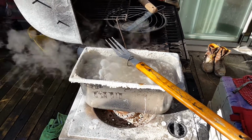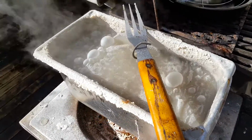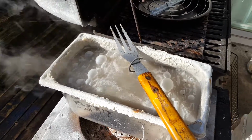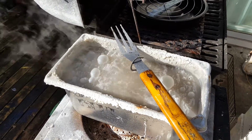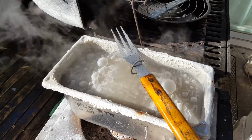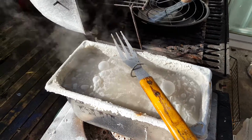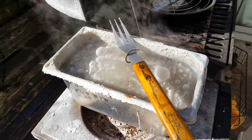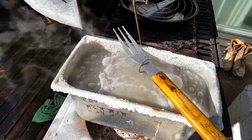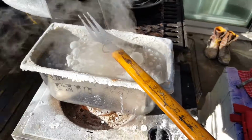So thanks for watching my nasty mess in the backyard here. One more thing, if you're bluing, it's got to stay at 292 degrees. Parkerizing is more like 190, but 180 maybe, but hot bluing 292. So get a little candy thermometer. I've got one, and if your mixture's right, you just want a simmer just like this, like a low bubble, and then you're doing it right.